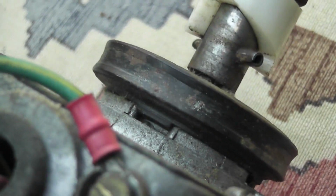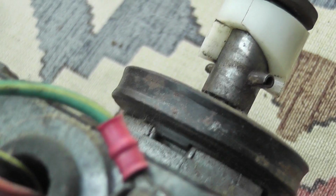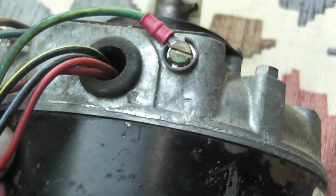So I've got a bundle of wires here. The way I look at it, these wires going inside are a red, a blue, a yellow trace and a red one. I think these are going to the motor windings, and then there's a couple here, brown, white and then a blue one that is probably going to the switch, which is behind this cover here. So we're going to have a look into that.